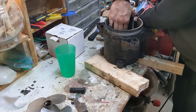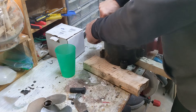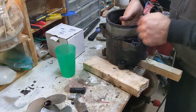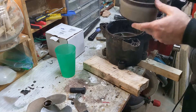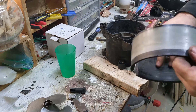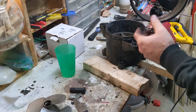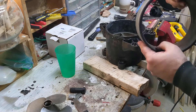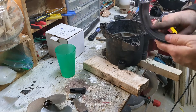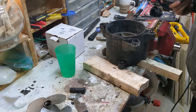It's coming. It's not all the way cut through in the very bottom there. There it is. It's got some wear in there — mainly the clearance between the impeller edges. This has to be about one millimeter. Because this is pretty scraped up in here, that would have created a little bit of turbulence. So just standard stuff to replace these.